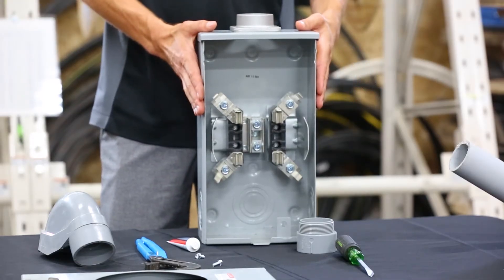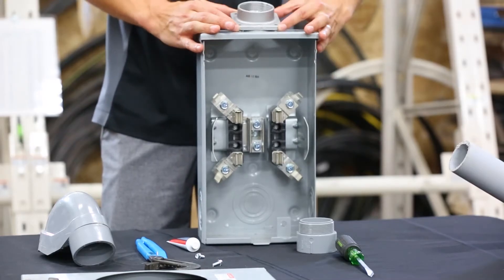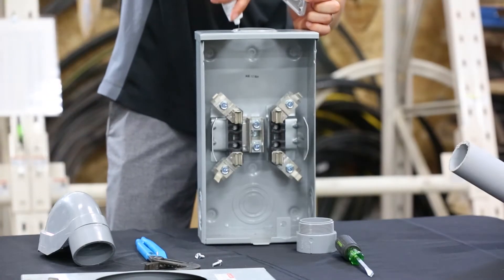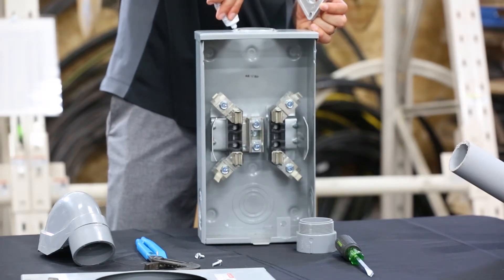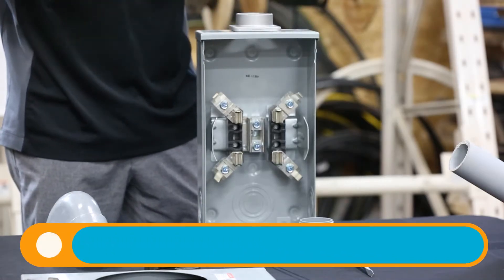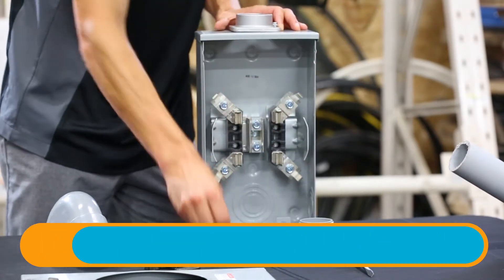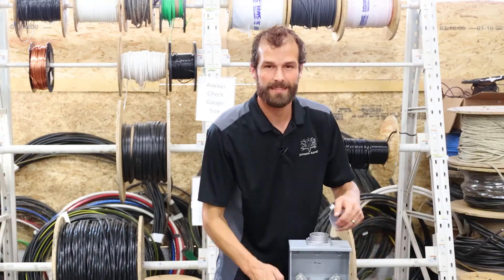This is my 200 amp meter cabinet. This is a two inch threaded hub that's rain tight. I'm going to apply NOLOX or anti-oxidation compound to every threaded ferrous exterior connection — in this case, the screws that secure my hub to the top of the meter fitting. I'm going to both waterproof those screws as well as prevent rust in case of servicing.